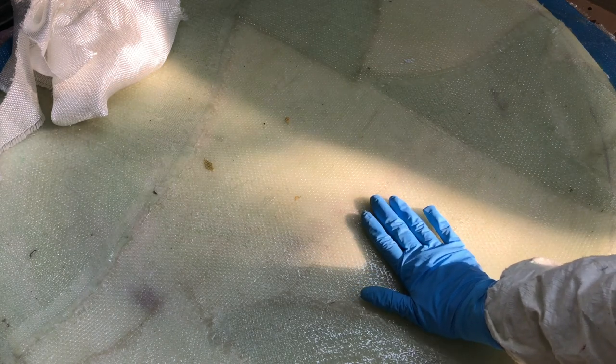Now that I've spent time building up with fiberglass, I'm going to do my last layer. You can see I have patchworked it from different strips. I try and use all of the scrap fiberglass to not waste anything, and that usually goes into my molds. For the actual pieces, I try to make it one strip to keep everything flat and perfect, but I patchwork a lot for the molds.